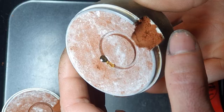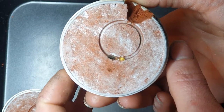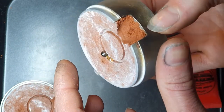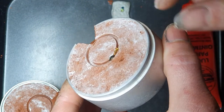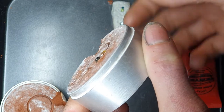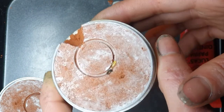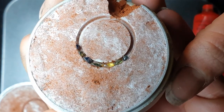Let's lay the rest of the stones down. I've laid those stones on that vertical wall and the tables of the stones are just kissing that clay wall. See how the stone is half poking up out of the clay? It means that the parts that are proud will fit into the opposite side, so the stone should end up being roughly in the middle of the band. You can see all those stones laid up against that vertical wall.